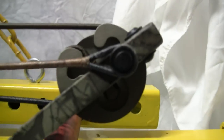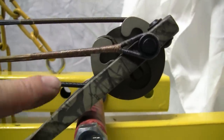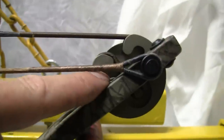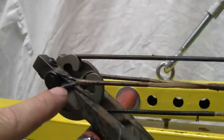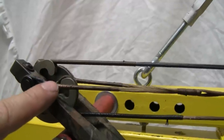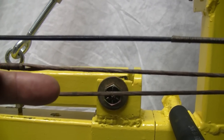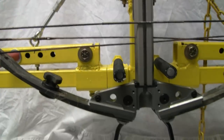I believe I need to loosen this one up, because this cable is pulling a little bit more — pulling this cam a little bit more this way, making it rotate a little bit more. I've got to come down to this end, loosen it back up, take this cable loose off the yoke, untwist it about three times, then put it back on the yoke and tighten it back down. Then we'll recheck it and see if that's close.